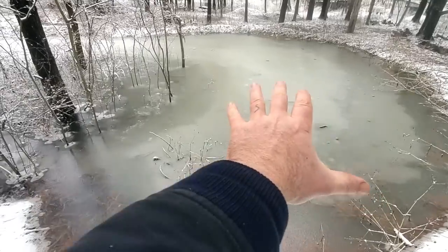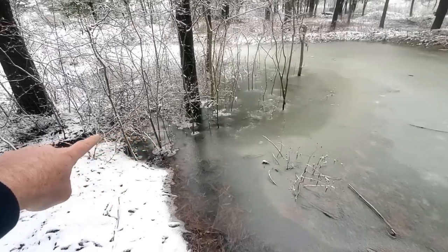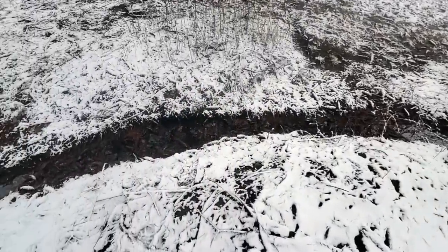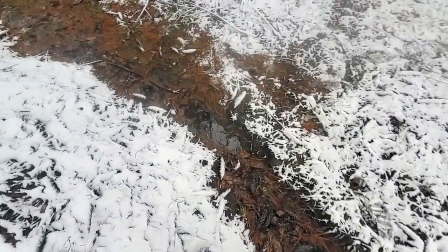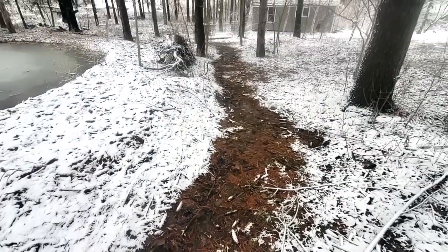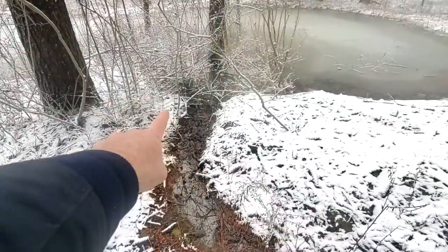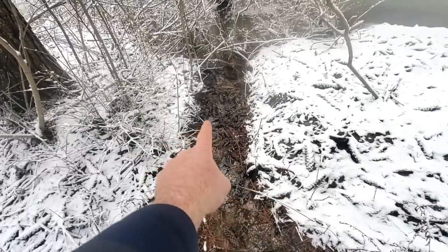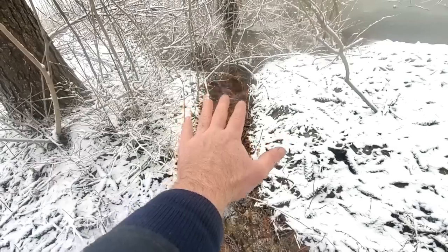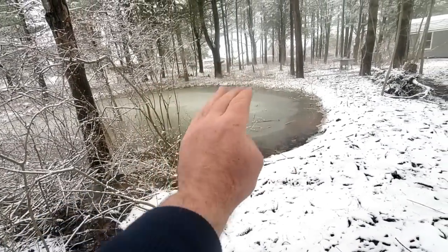So what we've done is said, okay, you can fill and then come over here, go through this debris and then come out and around the berm, through some vegetation and rocks and material, and then drain, not super aggressively, not through pipes, but out this way. And I think what I need to do is bring that spillway down a little bit. I'm going to do a little bit of work in here. Some of this bulk material in here would do well to remove. I'd like to go down a few inches or so, so that the pond static level can drop a few inches, which would give us a little bit more freeboard or buffering before it would want to overflow that way.